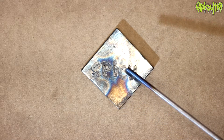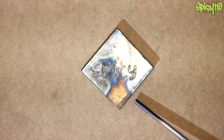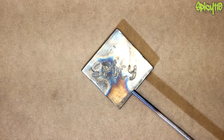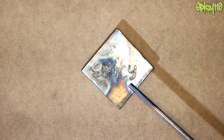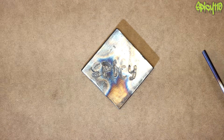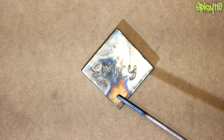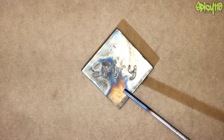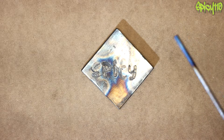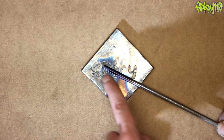You should now understand that the reason you're seeing different colours is because you've got different thicknesses of oxidisation layers, closely representing the temperature the steel got to. This is a trick that's been used by blacksmiths, knife makers, and sword makers for a very long time. The colour is very relevant to hardening steel — you need to get it to a set temperature, and people have long used these colours to visually know what temperature the metal is. In the past it would have been 'wait till it's straw yellow, then do it.' That causes a change in the crystal structure of the steel, resulting in hardened steel — much stronger and harder, but more brittle.